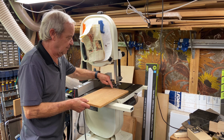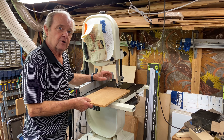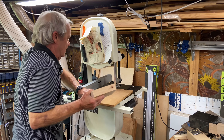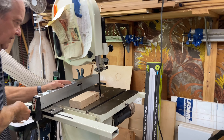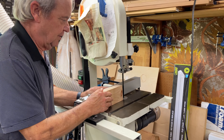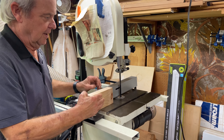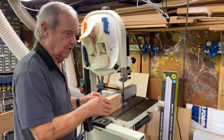With this half-inch blade, I might be able to cut a curve with a three or four-inch radius. You can cut a variety of materials with a bandsaw — it's a very hardy saw. You can also take a thicker piece of wood and resaw it to make it thinner. Resawing means taking a thick piece of wood and making a thinner piece — for example, taking three-quarter inch wood and making it into half-inch wood, or two-inch wood into one-inch wood.